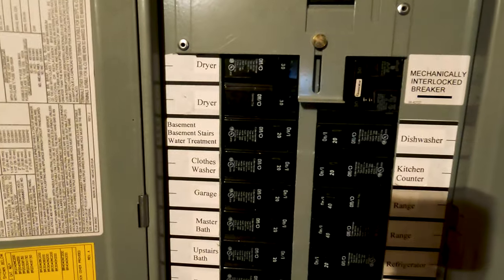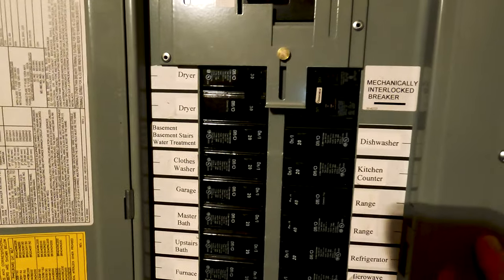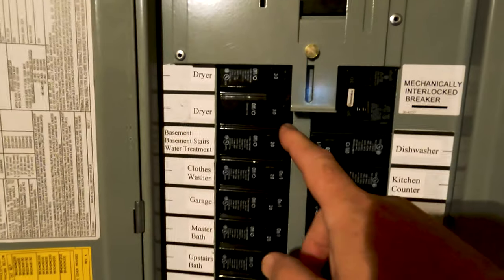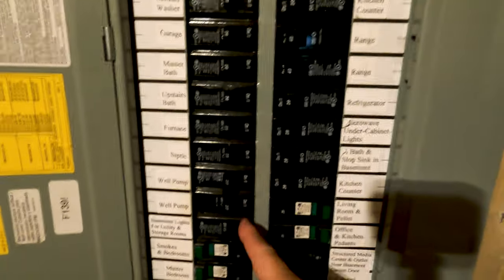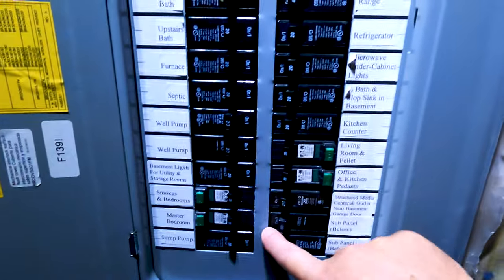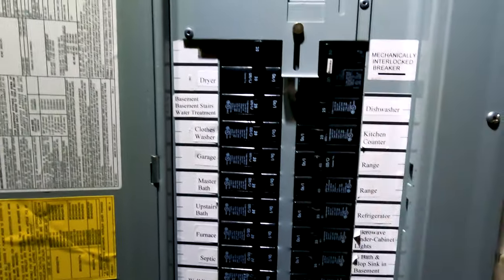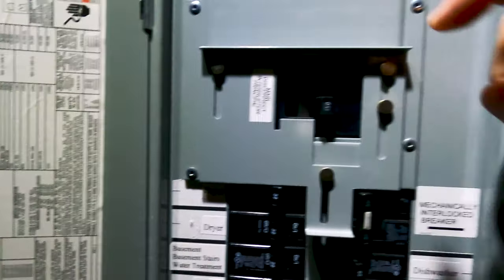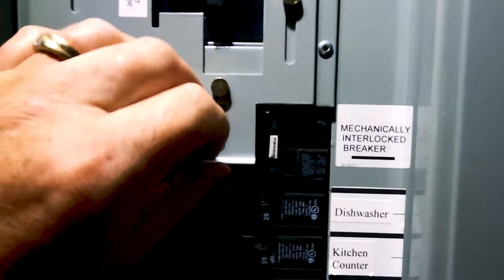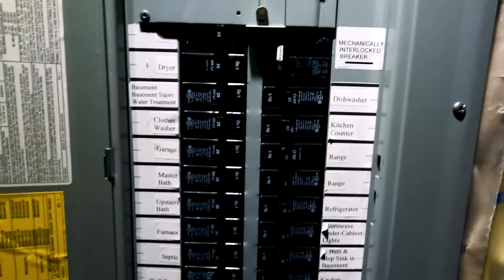So when I start shutting these down, the emergency lights, which I have up here, will turn on. It allows me to get down here when it's dark out and I can see and get to the panel. Let's go ahead and shut things off. Emergency lights just turned on. All right, so all the power's off. This switch over main power is off now, and I can engage the interlock. So now we're running off generator power.